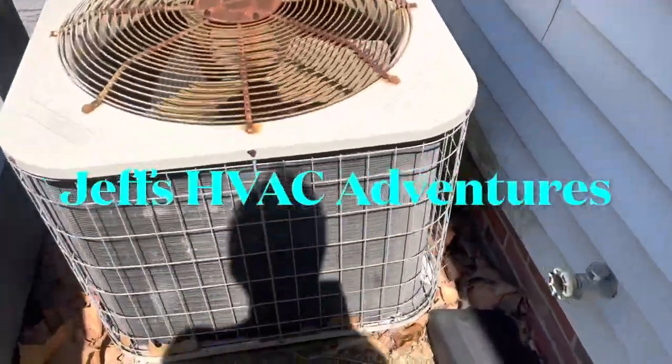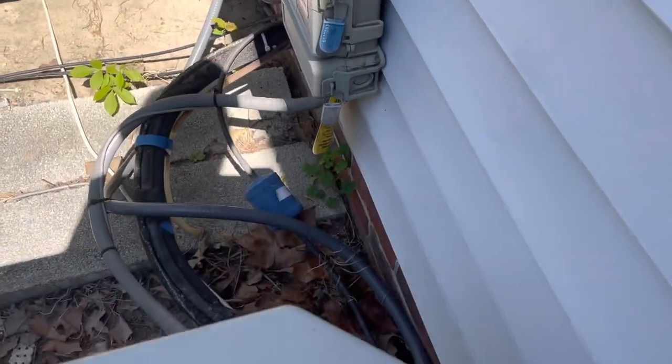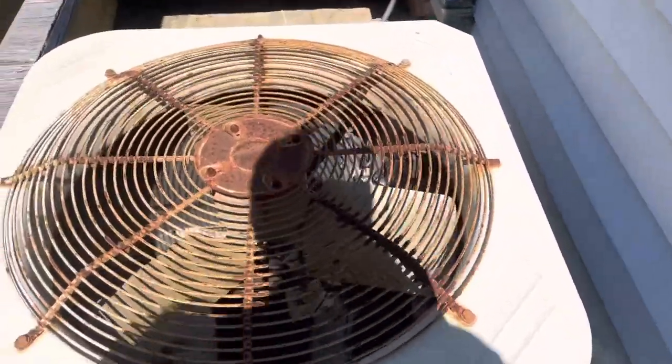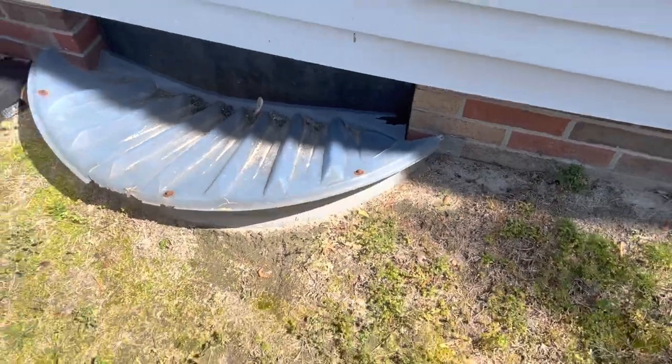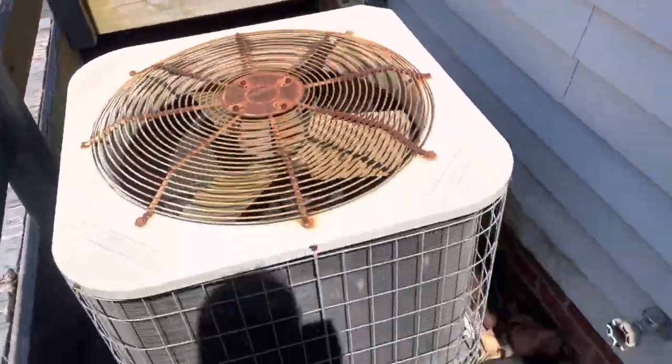All right, we got one here. The thermostat is calling on, saying heat, but we have nothing coming on. So chances are we have a low voltage issue here, but before I shimmy into there, let's try to shimmy back here and see if we have R.